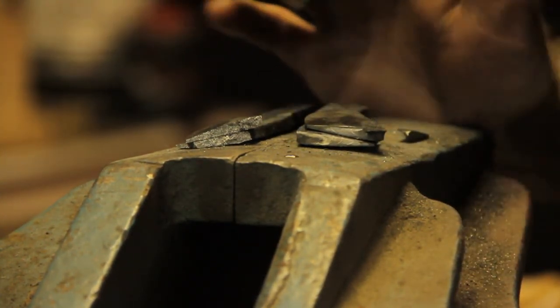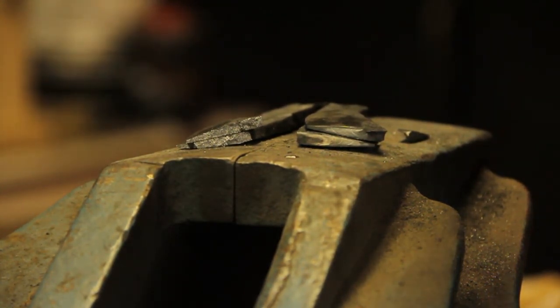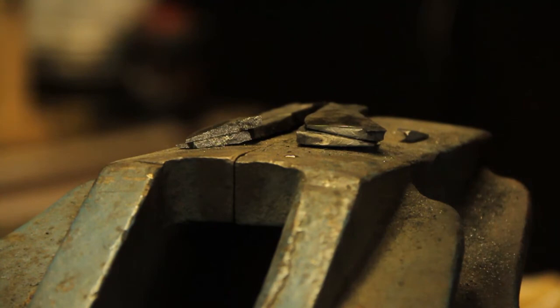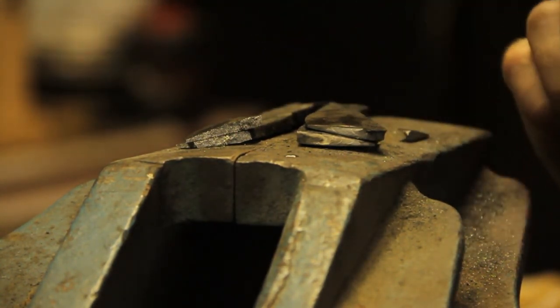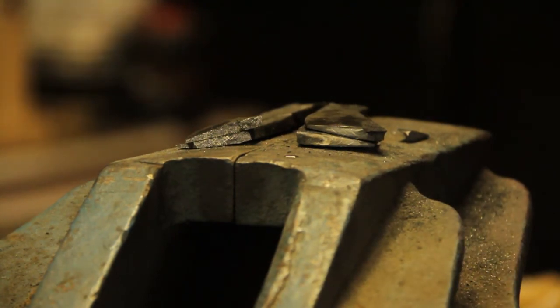I'll see if I can get some better images of these, but hopefully that goes to show the considerations you need to take into account when you're forging. If this was flat bar stock, you would probably be fine to maybe not even normalise, depending on — you've got to know the steel, you've got to do a few experiments. It would hopefully be sorted out at the mill where it was produced. So for stock removal, not too much of this applies. You do still need good temperature control when you do your hardening, but for forging these rich alloys, you do need to repair the steel at the end of the day.